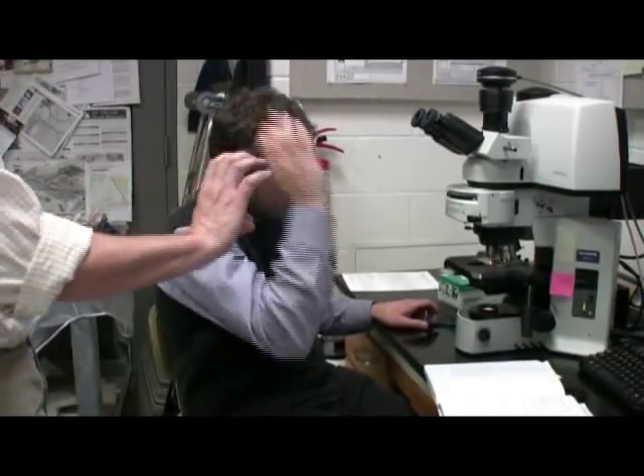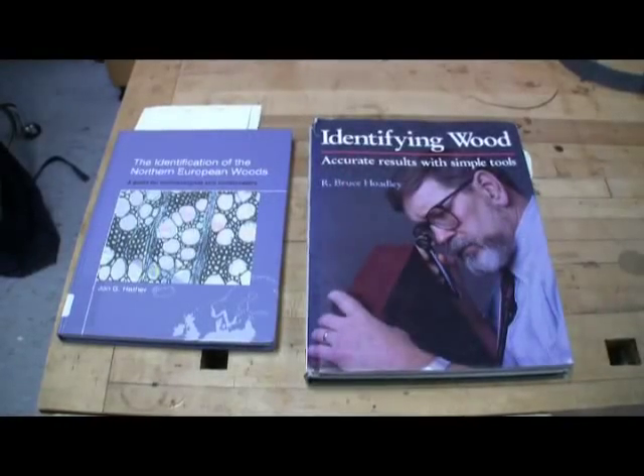What do these microscopic data points tell you about different wood types — what does it include and exclude? I have to go back to the books at this point and sort of go through some of those choices. It would certainly exclude all of the ring-porous woods, for example. Ring-porous woods would include oak, ash, hickory, chestnut — all of those kinds of woods — completely out, and you can tell by looking at the wood even by eye in that case. But this confirms this is a diffuse-porous wood, which means a very dense, closely grown cellular structure — very solid.